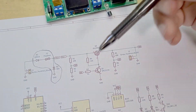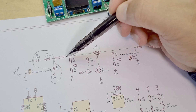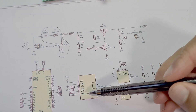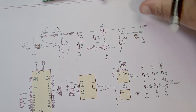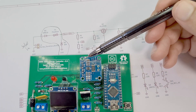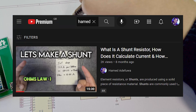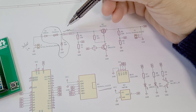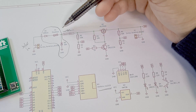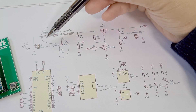Here I have V+ and V- connector tabs - very useful when drawing schematics, I just discovered them a few weeks ago. V+ connects down to the INA219 current sensor module. I have a video on shunt resistors if you don't know what that is. I could have put a shunt resistor - like a 0.1-ohm resistor - and detected the voltage across it using the Arduino's ADC to work out the current from the solar panel.